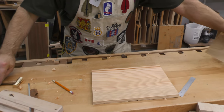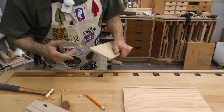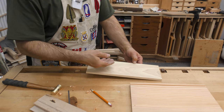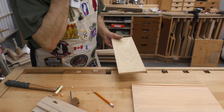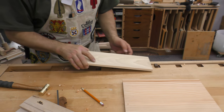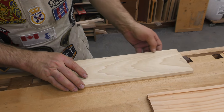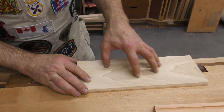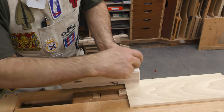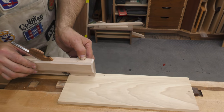So in order to do this, and sometimes you just end up fighting the grain because it only cuts in one direction. Meaning if the grain is running this way, I can't turn it around and cut that direction. I have to cut against the grain. Hopefully it'll be with the grain with at least one of them. So I need to set this piece up. Again, checking to make sure I'm cutting in the right spot. I want just a little bit of the drawer hanging over. So in doing this, I've got to have lots of support up here so that this starts cutting on the proper plane. It'll engage,